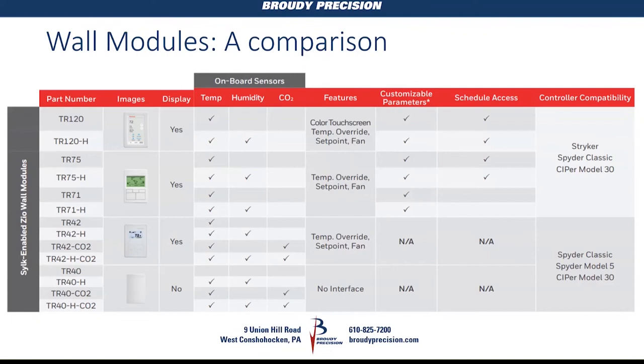The micro VAV Spider-5 sitting on a dollar bill — yes, that's a real product. Beta units are expected to arrive this month, but the initial devices are not plenum rated, so they're intended for bench testing. If you put them in a box in the field, you'll have to replace them later when the plenum-rated version is released.